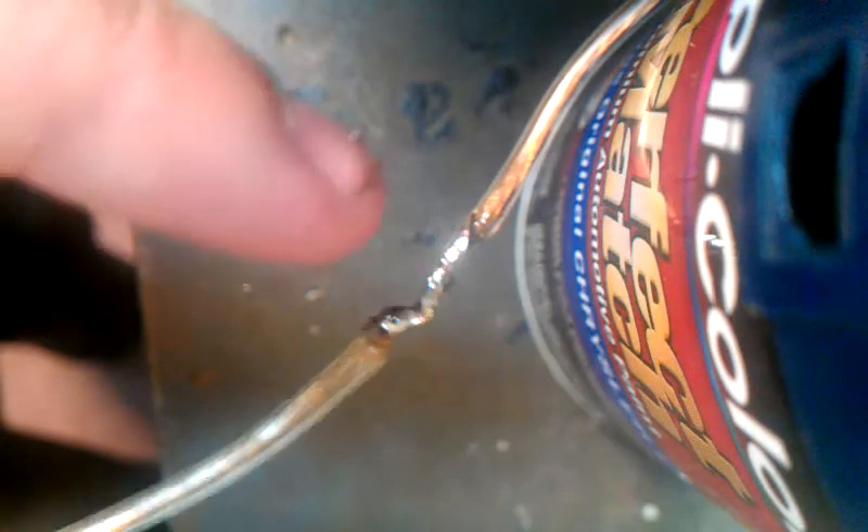And to clean it up, of course, you really don't want that exposed around other electrical wires. Just put shrink wrap on it and you're good to go. It's a lot cleaner. It kind of strengthens it up, but you really don't need any more strength than that. It doesn't hurt, but it'll definitely cover up your connection so you don't have any bare wire and it doesn't short out anything else.